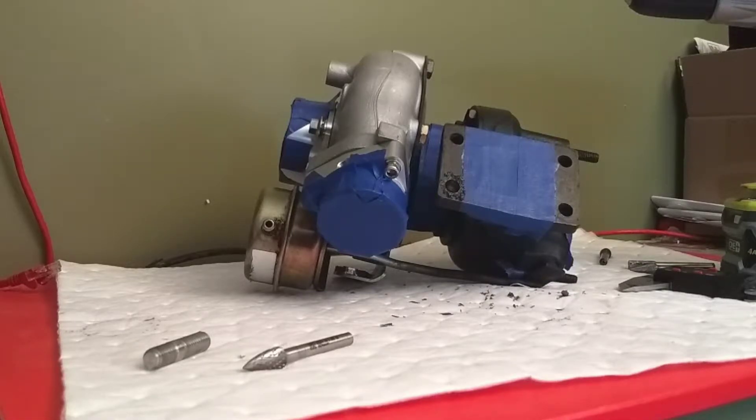I hope this helps you guys out. If your holes are already circular — not oblong, or were never drilled out further — you may be able to get away with just using a drill bit versus having to use burrs in combination with a drill bit. The oblong thing is really what apparently screws you up. Good luck, and if you feel you're not up to the task, go to your local performance shop and I'm sure they'd have no problem doing this for you.